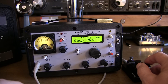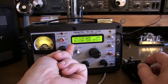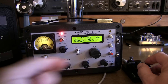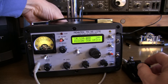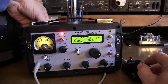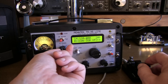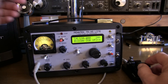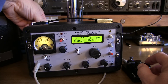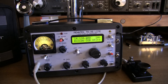Once I start to get some reflected power, I key down and start adjusting the knobs to minimize it. It looks like I hit a nice minimum spot there. Once I do that, I turn the power up some more — getting more reflected power. Let's minimize it again. There we go — we dropped it right down to zero. Then we turn the power up some more. Now with the power all the way up, I'm not getting much reflected power. Boom — now I've got this thing dialed in with no reflected power. I'm properly tuned up and ready to roll at full power.